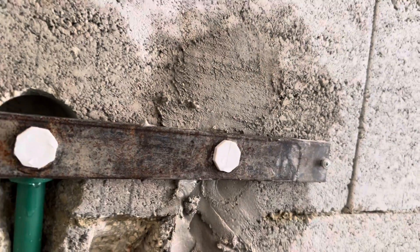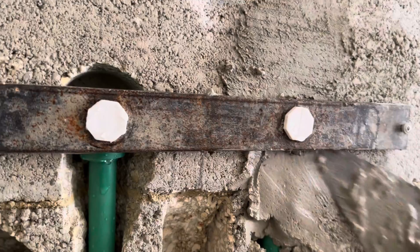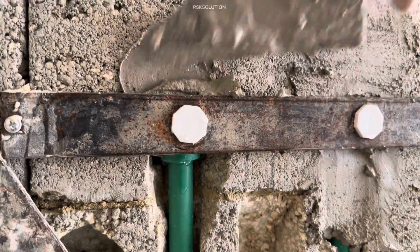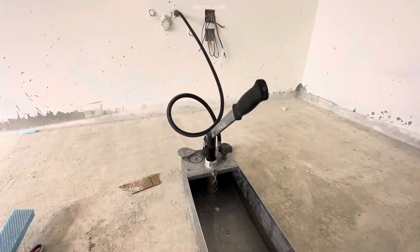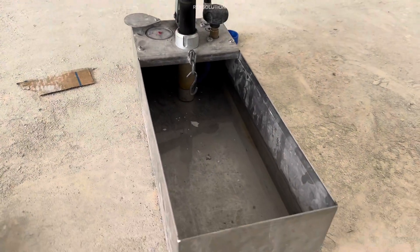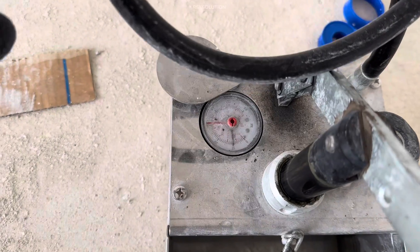After this, you need to plaster the wall plates. If you have this kind of metal plate, they are very useful — you can make it level and the face is going to be straight. Make sure you make a good plaster so the wall plate never gets moved; this is very important. Now you can see the plaster is done: shower mixer, wall plate sink, drain, and flushing. Then we are going to make the pressure test. It is very important when you work with PPR or any plumbing — make sure you make a pressure test. We are going to use 10 bar pressure for that.